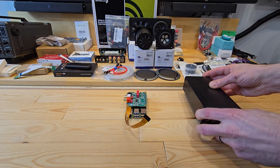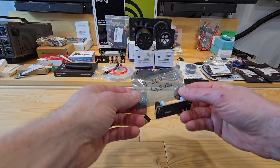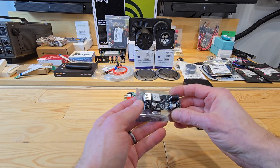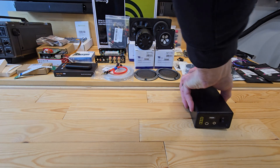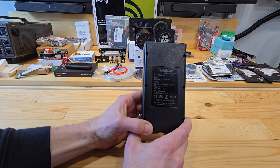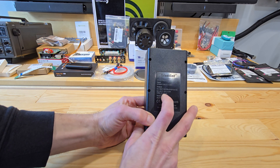To ensure the Pi has enough power, I will be using this DROC buck converter, which takes 9 to 36V and steps it down to 5V 5A. The right side is for power input from the battery, and the left side is for output to the Pi. Given the wide input voltage of the buck converter, I can choose to use either the 12 or 24V power output of the Talent Cell battery. However, I will use the 24V 5A solely for the Dayton Audio, and the 12V output almost solely for the buck converter.